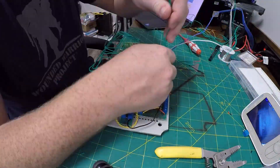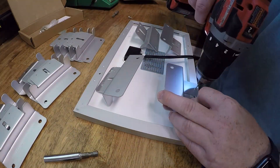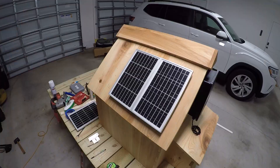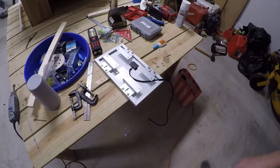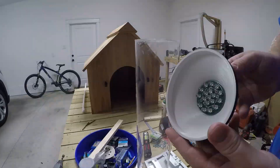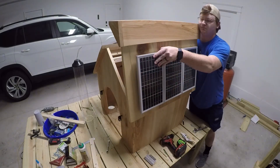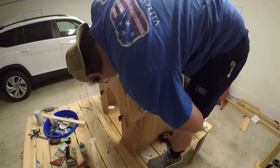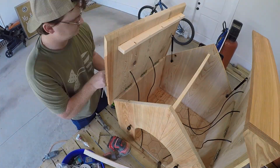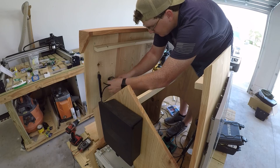For the solar panels I am using six 12-volt 10-watt panels wired in parallel to give us a total of 12 volts at 60 watts. I mounted these panels with aluminum Z-brackets — I believe I actually mounted them backward, but by mounting them inward it came out a lot cleaner looking. I also installed the LED assembly for the aquarium that will get epoxied in. The key with mounting these brackets facing inward is to super-glue the nuts onto the bracket; it can be a little tricky to line up the bolts but once you do it helps with the initial threading.